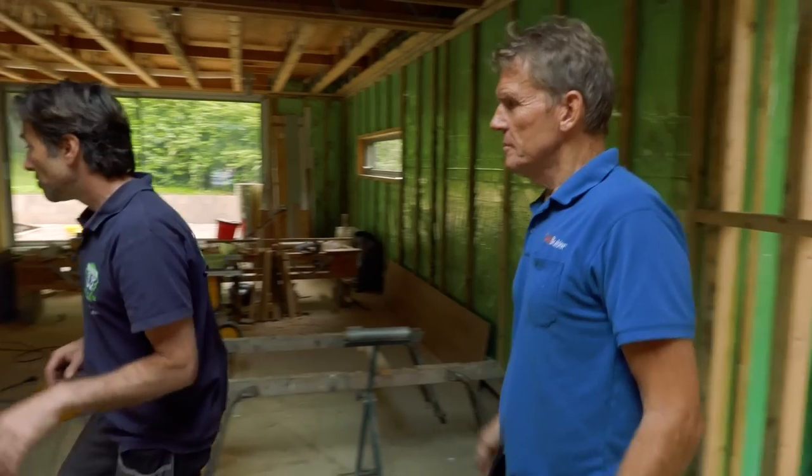So the electrician can walk in and say socket, socket, socket. I don't mind plasterboard drywall back boxes, but I'd sooner have a metal back box because I like them to be really solid. I have seen before, if they're not particularly well cut in at installation, that when you're plugging things in and out repeatedly they can sometimes loosen up. And the lugs are horrible - sometimes they just pull out.